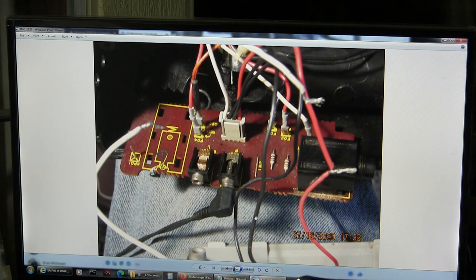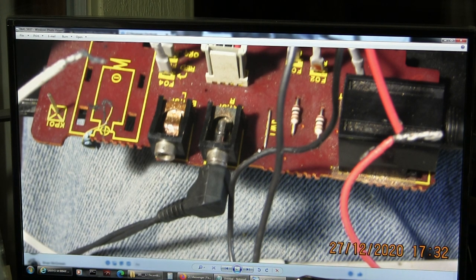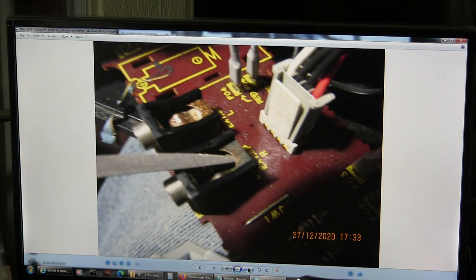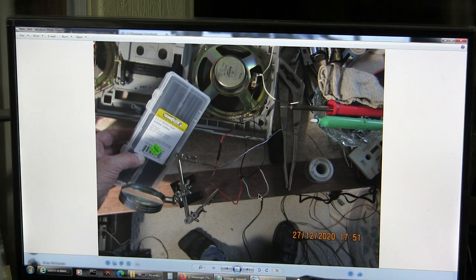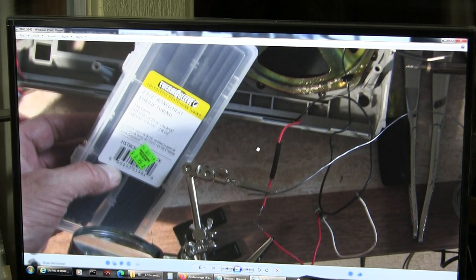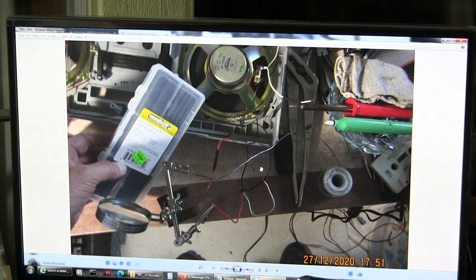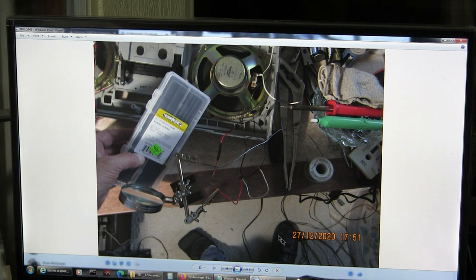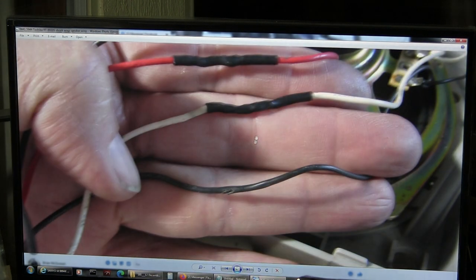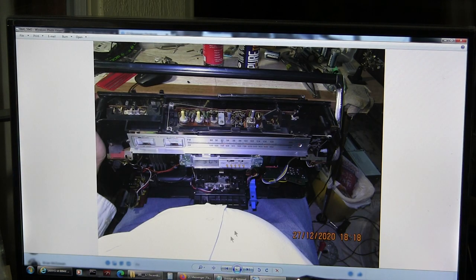So I cleaned that. I'm showing here how this is closed and this is open — when you put this in, it transfers the sound from positive to this tab here, but when it's closed, it's closed like that. Simple — I put my files through it. Now I'm showing my skills with shrink wrap tubing. You put the shrink wrap tubing on before you solder it together — you don't want to put it on after because that's much harder. There's a solder sucker and all that stuff. I soldered it, it's all nicely heat-wrapped together.